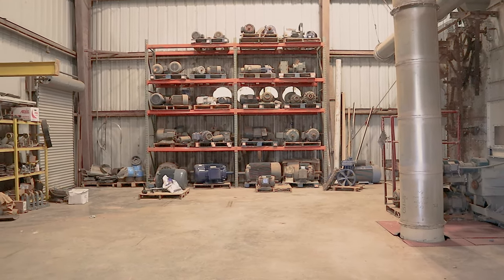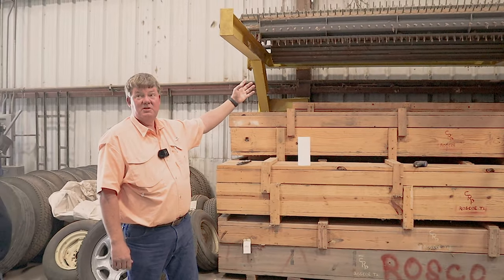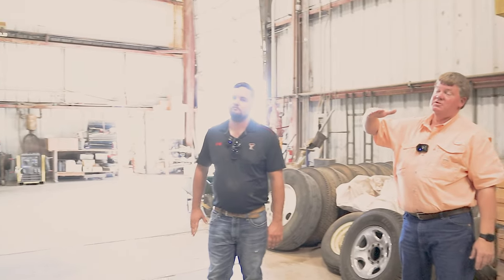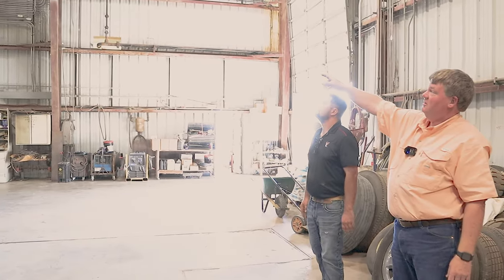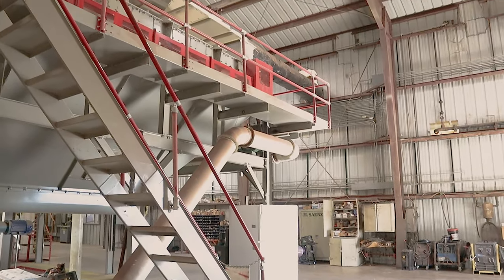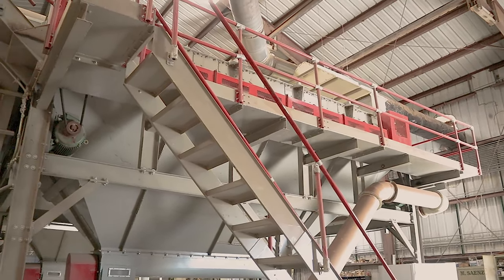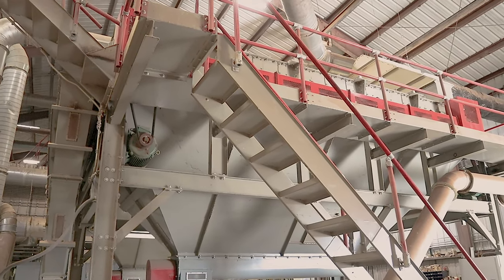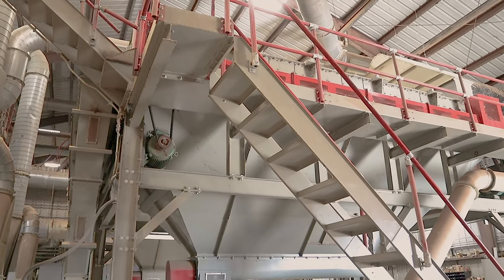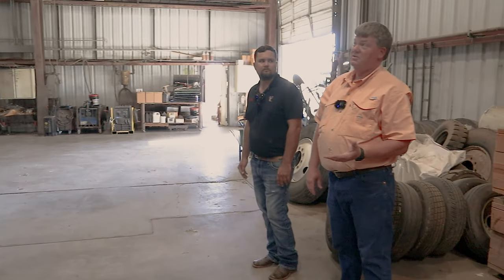So these cylinders are real similar to the ones we saw in the module feeder, but these go in our horizontal cleaner. It's called a horizontal cleaner simply because it's horizontal. The cotton we saw coming in on the outside of the heel of the elbow comes in that insulated line, hits that splatter box, and busts open. This machine is 12 feet wide with 15 cylinders. Underneath each one of the spike cylinders, it has some grid bars, spaced about 3/8 or something like that.